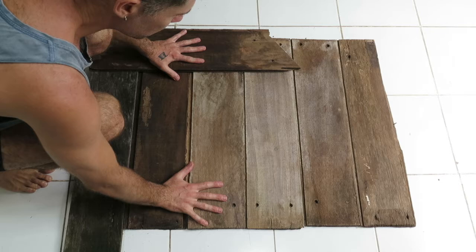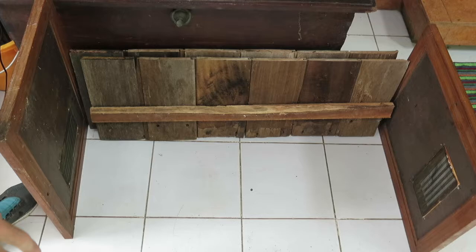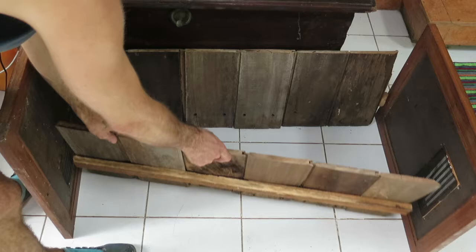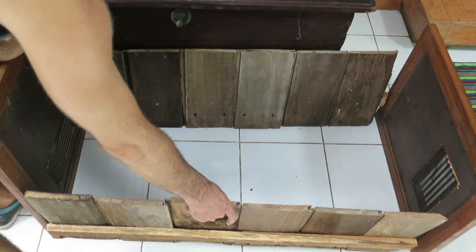This is my side panel which I'm going to cut down the middle, so that'll be either long side of the box. Then I'll add my two support slats and cut it down the middle. Here's the box sort of happening. I was going to do horizontal doors but that would make the box enormous, so I'm doing them vertically, which is a good size. Now I'm going to cut the legs, attach them to either end, then attach the sides to the legs and put support beams on.